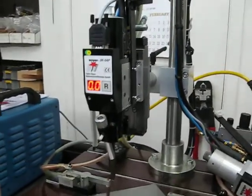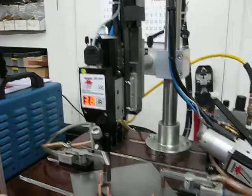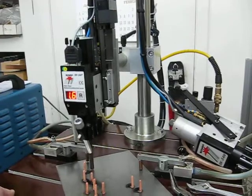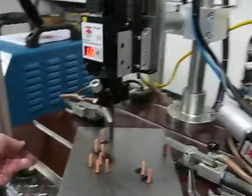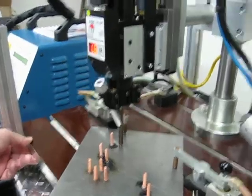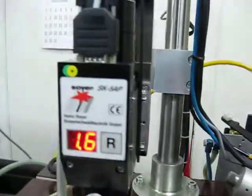I can hold these two palm buttons down — the head will come down, it'll do a lift, and then come back and rest. Whenever it stops its lift motion, that shows us our penetration. It's 1.6 millimeters now, so we want to set that to two millimeters.